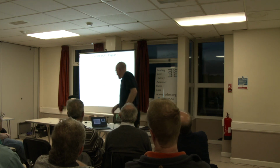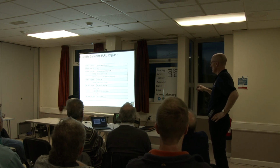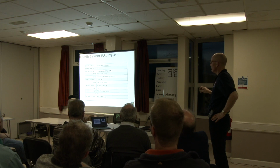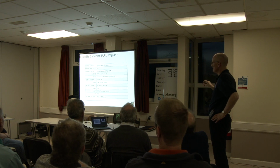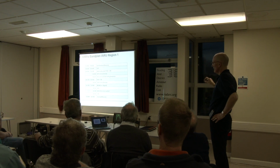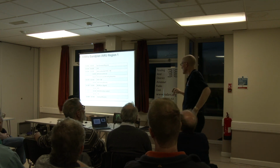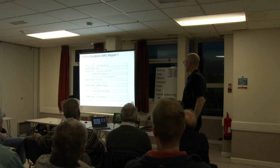That's the point. Just for reference, this is the current band plan. In region 1, they've cleared this region here for digital modes, but most of the activity is still somewhat lower in frequency. We have a preserve at 50.1 to 130 for long distance contacts, which is mostly followed actually. And most of the contests now don't allow contest QSOs, point scoring QSOs in that range. And generally speaking, CW below. The beacons, this is a bone of contention in certain parts of the community, but beacons are slowly and progressively moving into this range because they've got that exclusive as well.